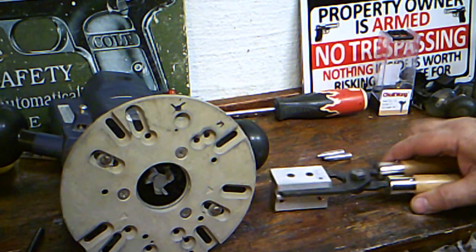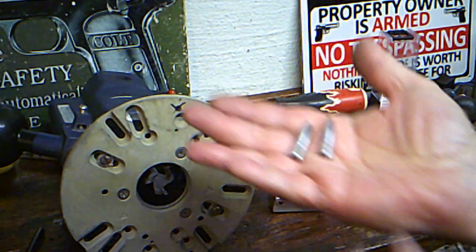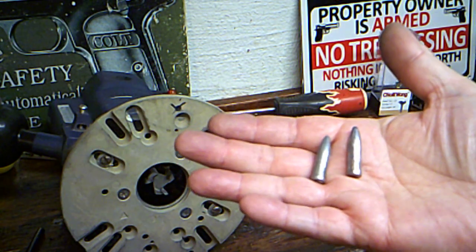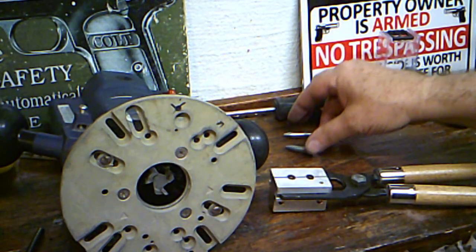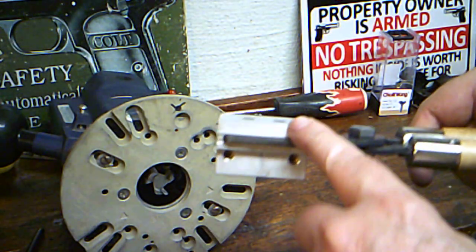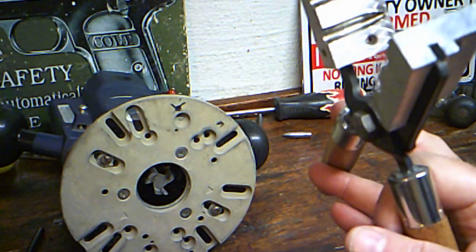What I did was made these bullets here. I cut off the boat tail just to see what length and what weight they turn out to be. I took the calculations from that and machined off that much off of the top of this mold. If you look — no more boat tail.